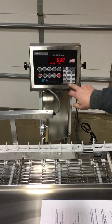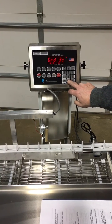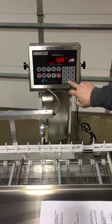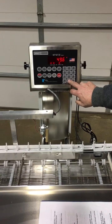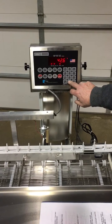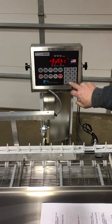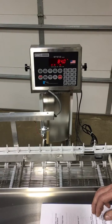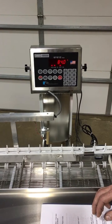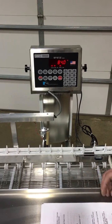Pressing enter again gives us grade two, grade three, grade four. The process is the same for all five grades. Then here we have the reject weight. You'll notice the reject weight is the highest weight of all — it needs to be the highest weight, otherwise all of the eggs will go down to the end and none of the kickers will operate.